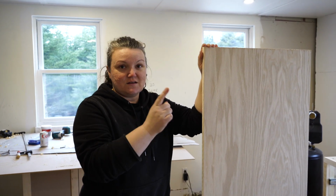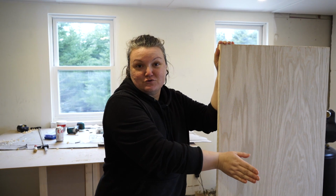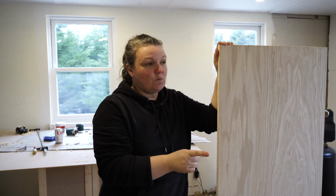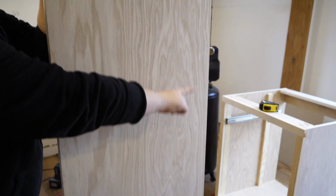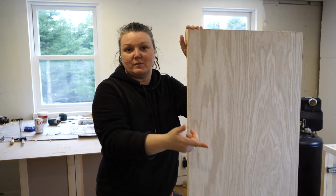So we're gonna cut those on either side, and then there's a little trick on how to know where your front and back part of your drawer measurements are going to be. So we're gonna do a bunch of cutting on the table saw. And because we wanna do 2 shelves that are 5.5 inches deep, we are going to cut 2 drawers worth at one time while we have the settings on the table saw the way that we want them.